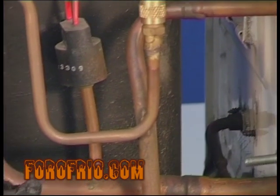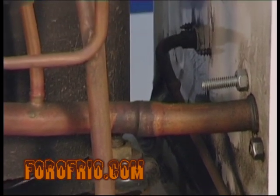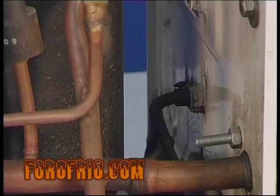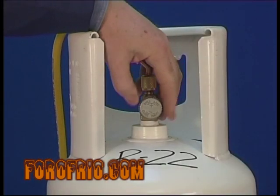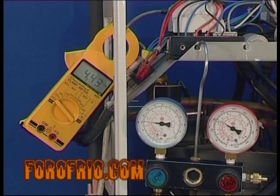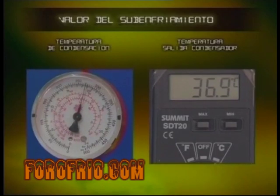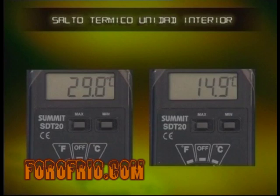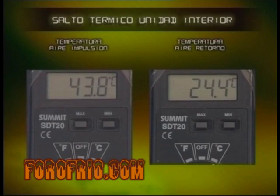If we have a low pressure in the heat cycle, either in the interior or in the exterior unit, we can charge with gas, low side and with the machine running, controlling the high pressure and the temperature values in the heat cycle, as well as the heat cycle in the two units, to diagnose an optimal function.